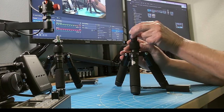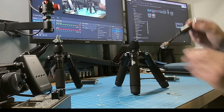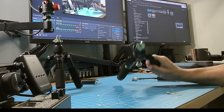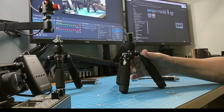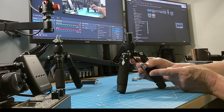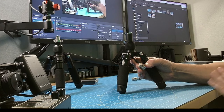What's changed is a second post, and with the second post, we now have 3/8x24. And so now we can install any antenna that's 3/8x24 that we have in our kit. If we loosely put a nut here, we can then add more ring terminals, and then when we bring our coax and tighten it, we can take our radials out. That was version number two.